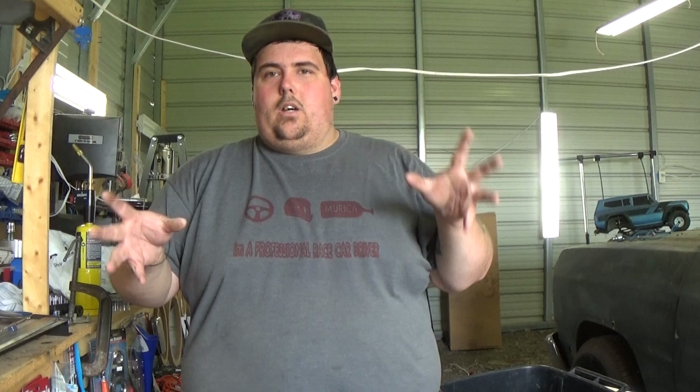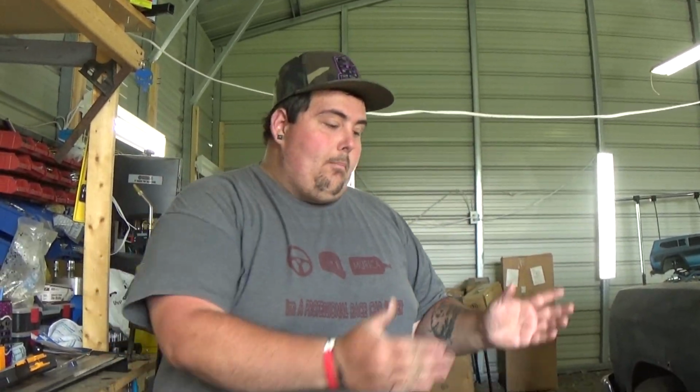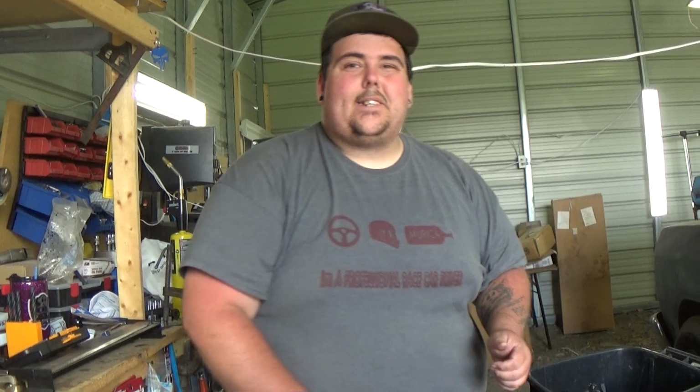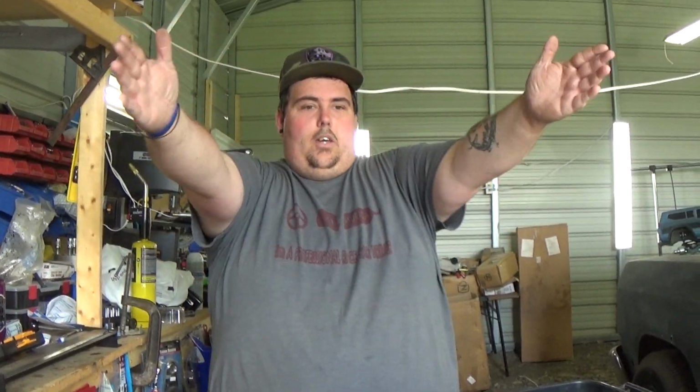28 inches, but the rear end's not cut yet, so I'm not going to cut it until I get the hubs for there and here, so that way I can make sure both. I can cut the rear end to match this, so however wide this is, the rear end will be that wide. So that way both wheels and everything will be good and straight, hopefully.